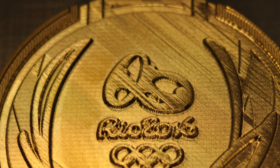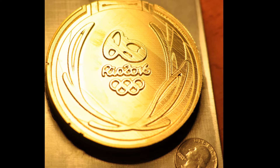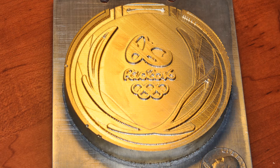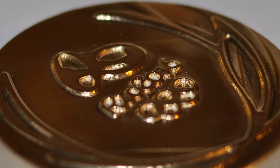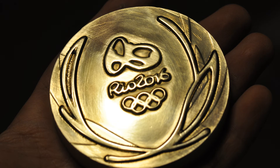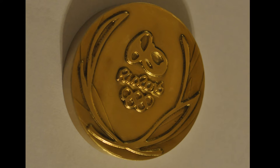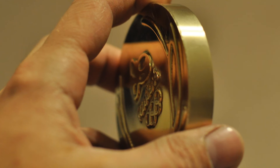For sanding and polishing, the aluminum backing plate was removed by resting it on a hot kitchen stove for a few seconds to break the CA glue. The STL model includes a ribbon loop at the top, and I'd left quite a bit of margin material — this was all removed with the mill and the belt sander. I started with 400 grit wet paper, which gave the brass a nice brushed finish and took off all the mill marks. This was followed by 1000 wet paper for a low satin shine, then 2000 wet paper took it to a shiny polish. A bit of rubbing compound and automotive wax finished it off. The back was left with a 2000 grit polish, and the sides with a 1000 grit satin.